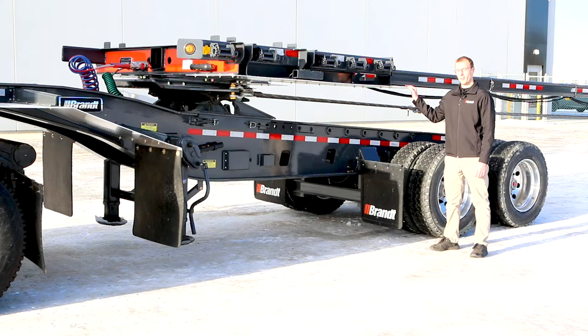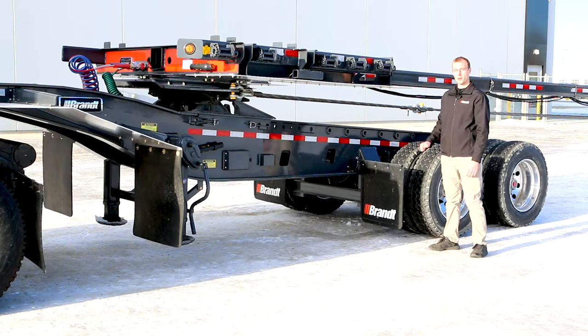We've also implemented a three-piece cable steer system that utilizes a heavy duty 7/8" cable that has a removable front section, meant to allow you to take it off anytime you want to change from the 80 foot position to the 60 foot position. That means one less set of full length cables the operator has to carry around, resulting in less weight and a quicker overall turnaround time.